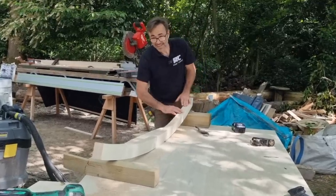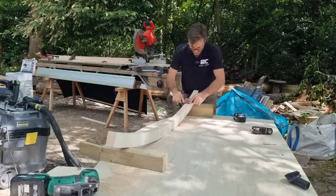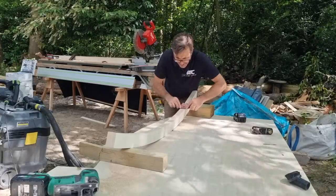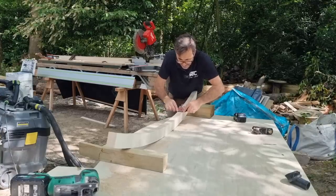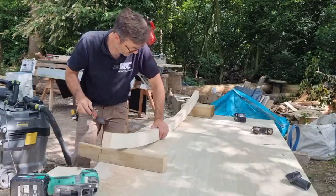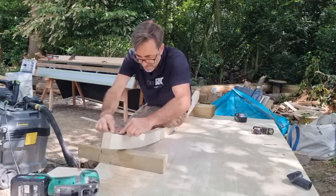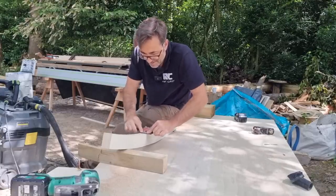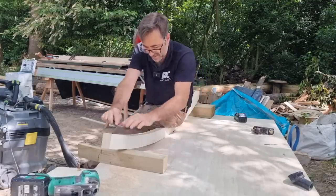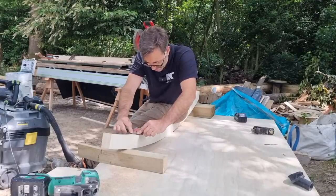I've got my first pair cut out and I'm going to smooth them out now. On the internal radius I'm using a spokeshave - it fits straight in and cleans them off. I've got a couple of sturdy blocks here to stop it from seesawing, and I'm just taking out all the high spots before running the sander over again. You have to sit on it like a boat builder. You can feel the high spots where the jigsaw does its own thing. It was quite a big ask for the jigsaw cutting two lots of this Streetech ply - it's so solid with so many plies.